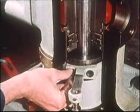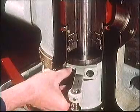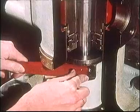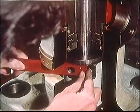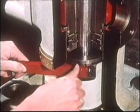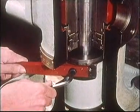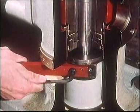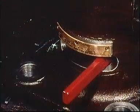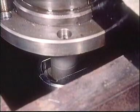Dismantle the arm for the regulating guide of the pump. Screw the red tool arm onto the regulating guide and turn this until the arm abuts against the right-hand edge of the cutout in the pump housing. This will make the plunger foot turn in the bayonet joint so that the plunger can be lifted out.